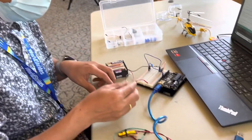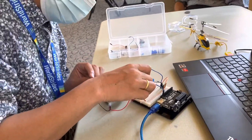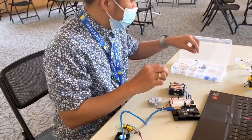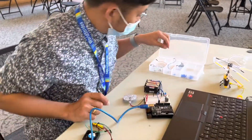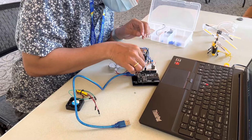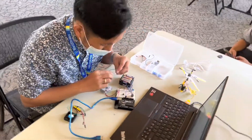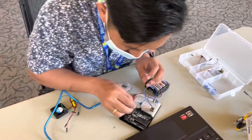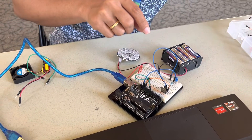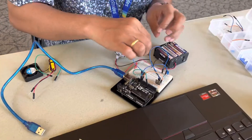Same as what we did with our fan — this will be going to power and then to the ground. Make sure to put your switch anywhere in the breadboard, but make sure it should be oriented correctly. The green one should go to pin 8, and do not forget to connect this lower pin to ground.